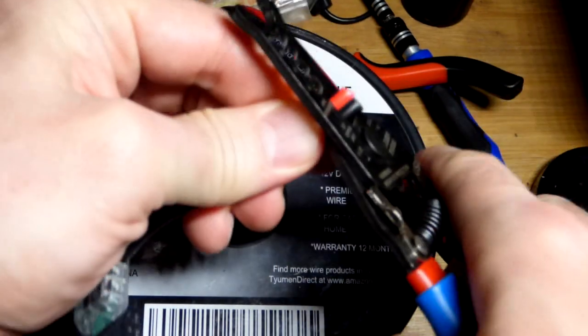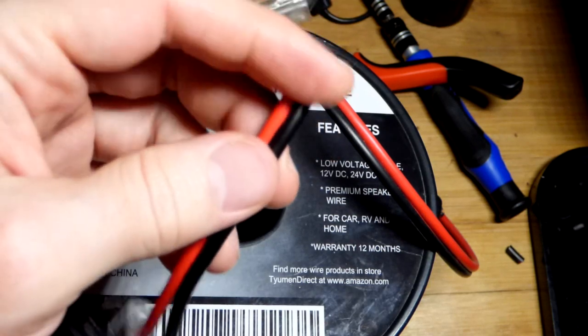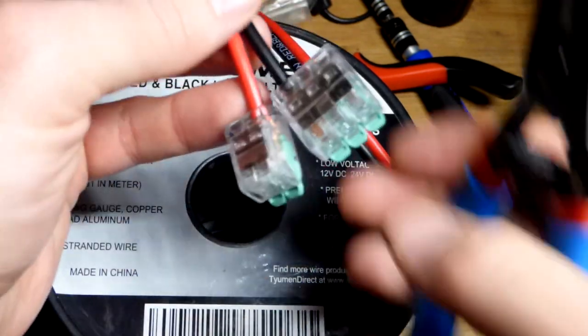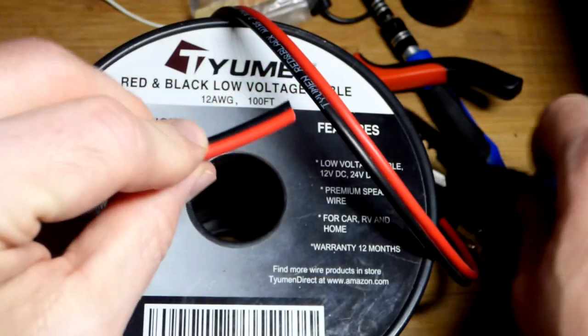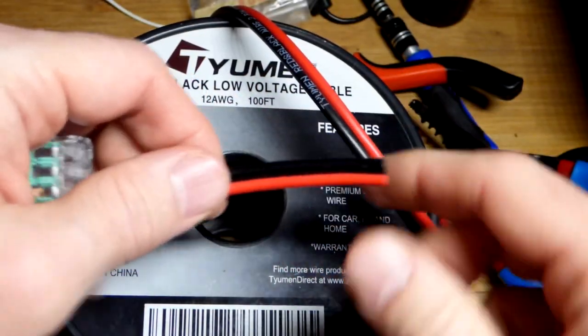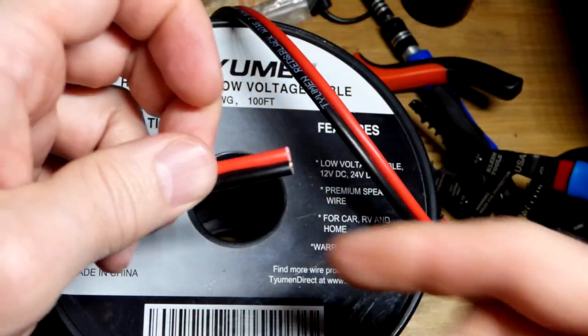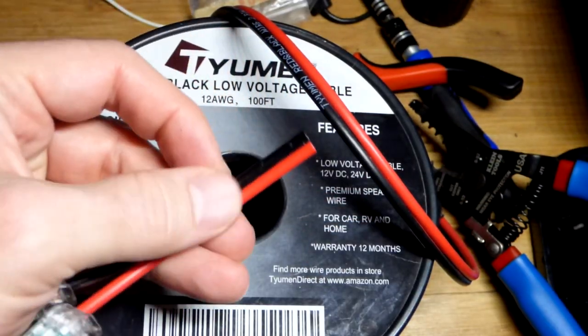This one should work quite a bit better — right there, cuts it off, kind of like cutting through butter. We've got strands there held in place by this, especially when you strip the insulation. I'm going to have to score this end right there before I peel them, and then I can remove the insulation.